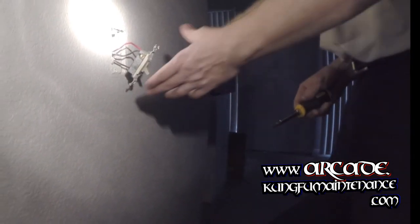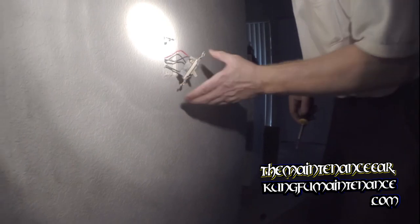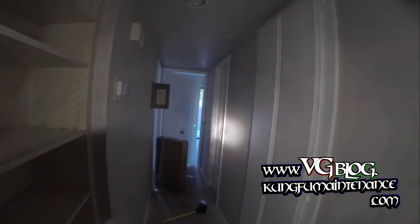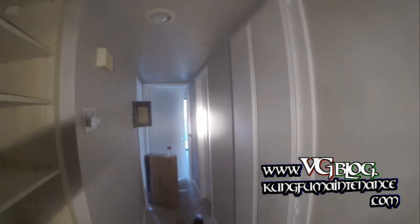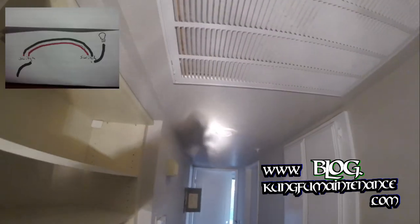The question is: where is our hot common wire? It's easy to tell on this one — it looks like the bottom black wire. Power most likely comes in down here, comes up to this switch, goes over to the light through the two travelers, and comes up to the light from the common screw. The switches control the light from both sides — that's how it works.